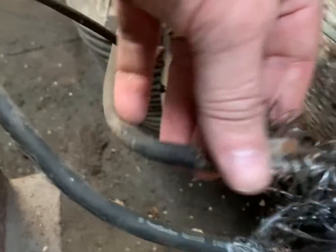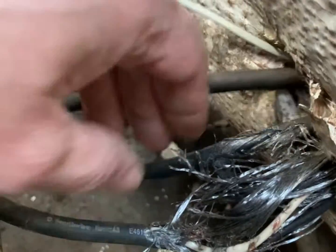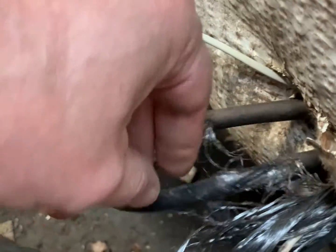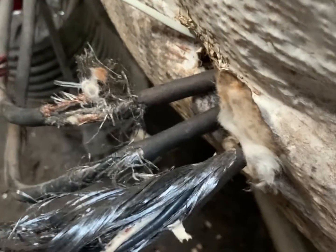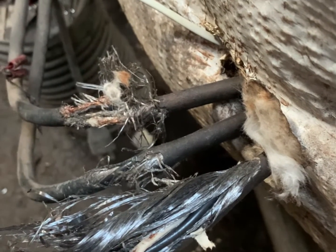This video is not over — it gets more and more interesting. As you know, there were mice and I replaced the wire. Everything was working good. I went to put it all back together and the fans automatically turned on for some reason. I checked the control panel, couldn't figure it out. I was trying to move some wires around and I heard a pop and something shorted. The mice came in and ate the plastic — all these are wires for the pumps, the fans, and all that. What happened is the wires actually touched each other and turned on the fans without the control panel. So what I'm going to do is pull them out, cut them, re-splice them in, and put them in right.